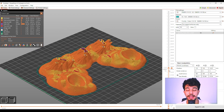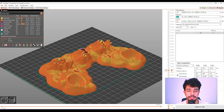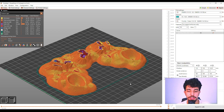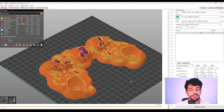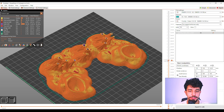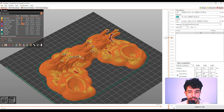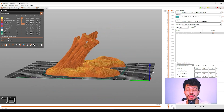By slicing, you can see layer by layer the model printing itself. Make sure to always check if the model prints on thin air — out of nothing. If it prints out of nothing, it's mostly gonna need support. As you can see, it builds the branches here and they connect, but this model never prints out of thin air, so it does not need any support as it's optimized for printing.